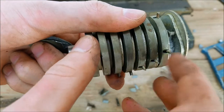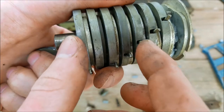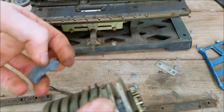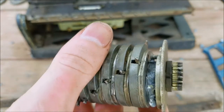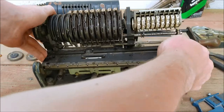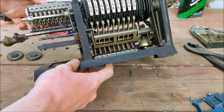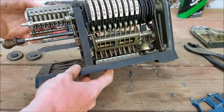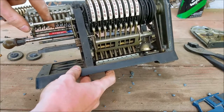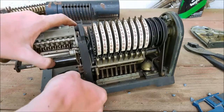See — look how nice the other ones are. You can see these things are spring-loaded, and those are the tens carry things. If you saw my previous video about the Brunsviga Model A, there are little things on the back here — these things pop down. If I turn this the right way it should eventually pop down — there it goes, see how it popped down. Those pop down and then as the pin slides past them, this pushes the pin over to turn the next wheel one place, and then this pushes this back up. So that's how the tens carry works.